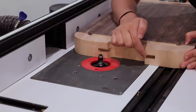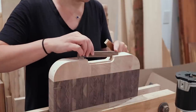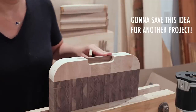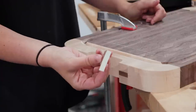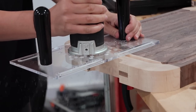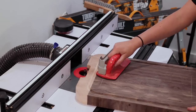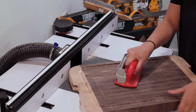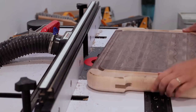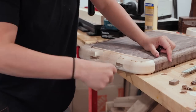Time to route the profile on the edges. Cutting the mortises earlier caused a problem — the bearing on my round-over bit would fall directly into those mortises and mess everything up. Easy fix: I put a temporary piece of walnut in the mortises, rough-cut the curve on them, placed them in with double-sided tape, then cleaned them up with a flush trim bit. Now I can route the giant round-over without worrying about the bearing going into the mortise. Those walnut pieces served their purpose and I popped them out easily with a chisel.